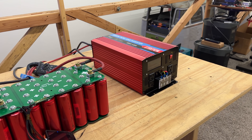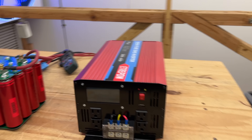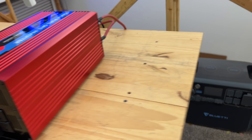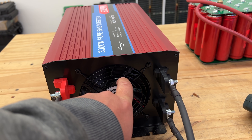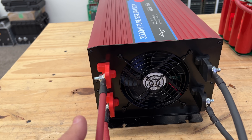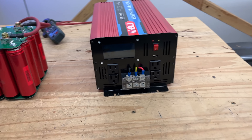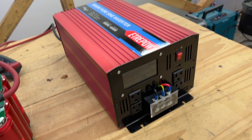This test is to be continued. This inverter is kind of crappy — at least this version of it. I loaded it up with 2,200 watts; it's rated at 3,000 watts with 6,000 watts surge power. But I think the problem was the fan doesn't work, so there's no airflow. I loaded it for at least a couple of minutes at 2,200 watts and then smoke started coming out. I'm going to return it and get another one to see if it does the same thing.